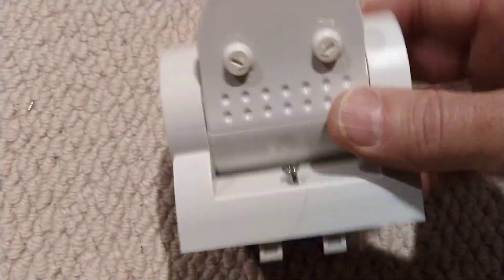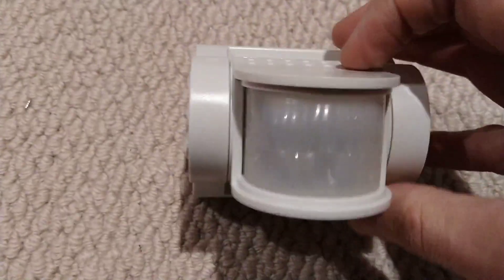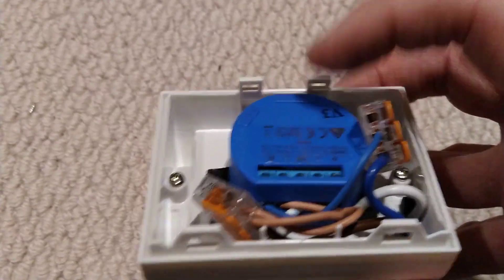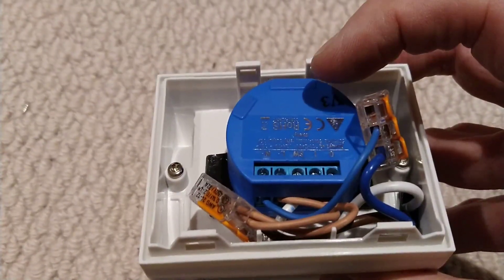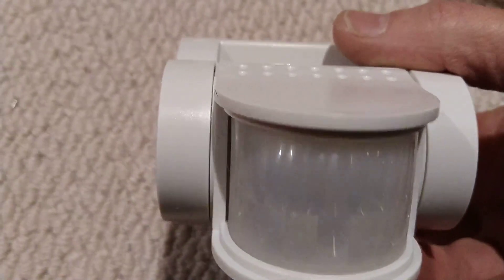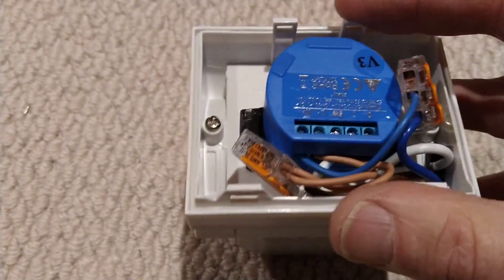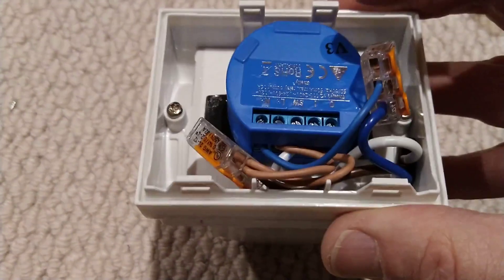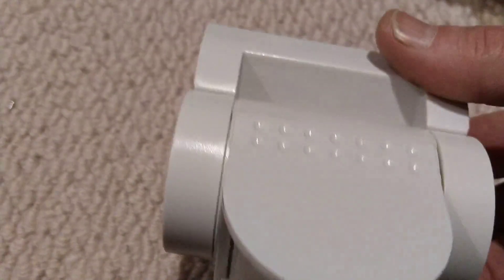I can basically turn the daylight sensor down to daylight and have the motion sensor going off 24/7. That switch input is what I'm detecting via MQTT - it goes to my broker and tells me 24/7 whether the PIR has gone on or off, which is brilliant. Then once it hits dusk, I have an automation that will turn the light on and off as per normal.